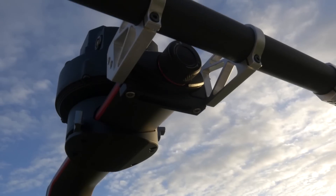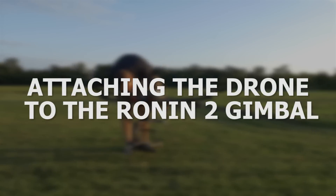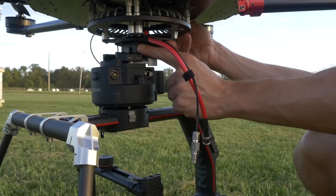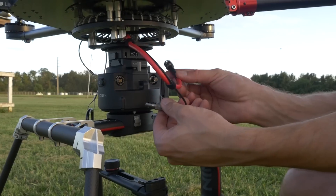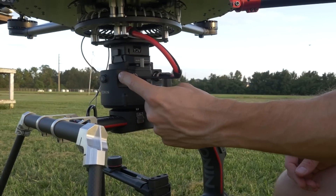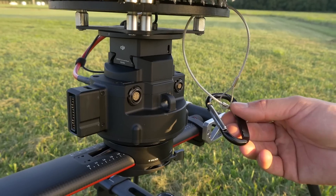The Ronin 2 aero landing gear has been assembled. To install the aircraft onto the Ronin 2, slide in the universal mount dovetail from the aircraft into the dovetail on the Ronin 2. Then lock it and plug in the SDI out and the CAN bus. The CAN bus plug goes straight to the A3, and the other goes to an HDMI converter on board, which then feeds straight into the DJI Lightbridge system. Lastly, attach the safety clip.